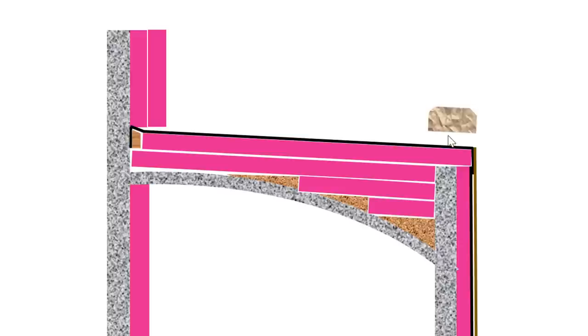I'll add a short stone wall on top of this wall to keep the soil in, but that's in another video. Notice that the insulation envelope is now complete, with insulation wrapping all the way around the thermal mass of the home. In most spots it's four or six or more inches thick; on the very top edge of that wall it's at least two inches thick. This top section gets carpeting to protect the rubber and the insulation, and then I'll add soil and grass, which will also provide very good thermal mass and moderation to keep the house comfortable.